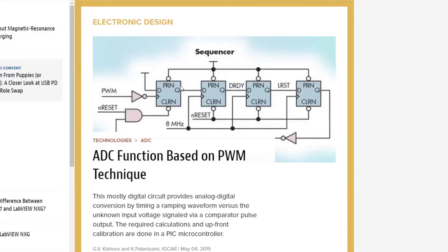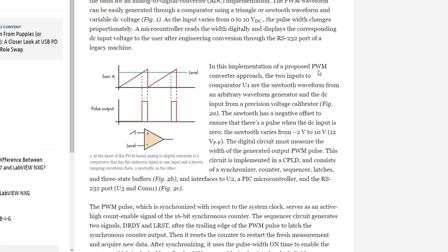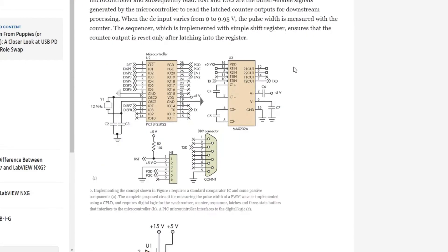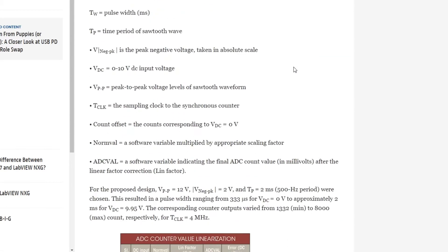I had a bunch of ideas on how I could solve it. The first — slightly more expensive and more advanced — is the ESP32, which has got many ADC channels, so that's one possibility. It may consume more power, so I'm not sure that would be my first option. The next option is you can kind of make your own ADC using a waveform generator with a sawtooth, some shift registers, and a PWM comparison to measure the off-time to on-time ratio. But this is just a really complicated and frankly quite slow way to get yourself an extra ADC.